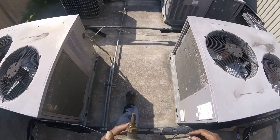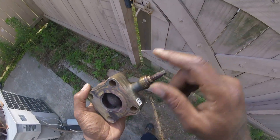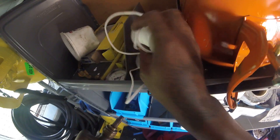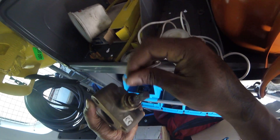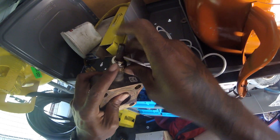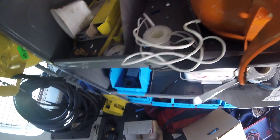I'll show you the cork tape. You'll close this valve whenever you have to do that. This is cork tape. Whenever your valve is leaking right here — because they do leak sometimes, or they'll leak right up here — you'll just pull this all the way out. You'll just fill it in there and tighten it back up, thread it back up.